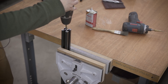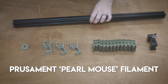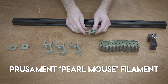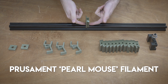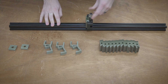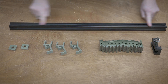I'm putting some little end caps on this just to clean it up and make it look a little more finished. Here are all the finished 3D printed pieces along with the extrusion. The end caps snap onto the end and look pretty with a little countersink. Then there are the actual brackets and the holders for the tool - these were a little tricky, I went through several iterations to get all the chamfers and geometry right. They sit on there with a hole through them so they'll just sit with a traditional t-nut. They fit relatively snug but with all the chamfers and drafts it slides on very easily and will always find its location.